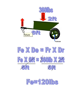The AMA would be the force of resistance, 360, divided by the force of effort, which would be 120. So if you take a calculator and you say 360 divided by 120, you get an answer of 3. What does that mean? It means that there's 3 times more weight in the wheelbarrow than what we're having to lift. So that's a mechanical advantage of 3:1. So that's huge. Same thing applies to the distances.